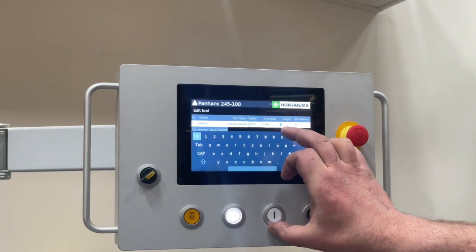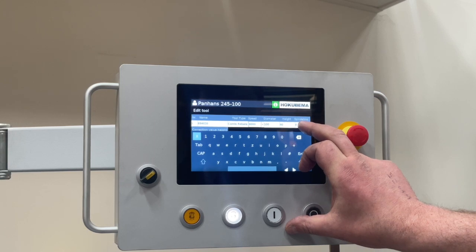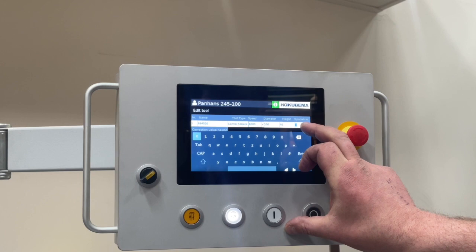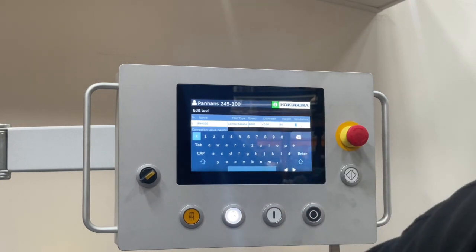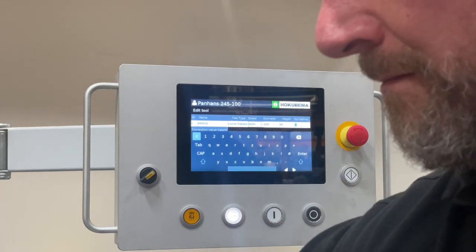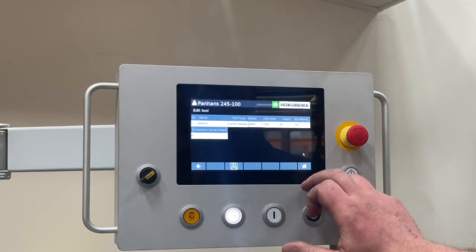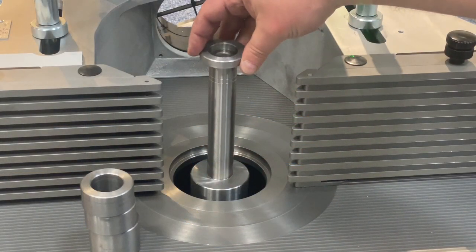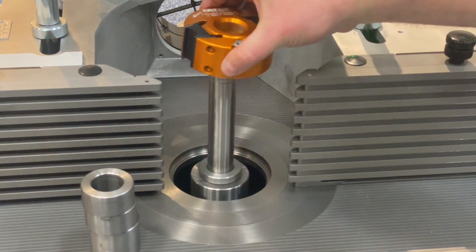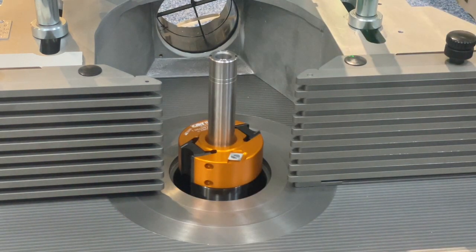Speed, diameter, height on this particular tool is 40. This point here explains the spacer that is underneath the tool on the shaft. So in this particular case, we're going to use a 10mm spacer. So we just enter 10 there. So there's the 10mm spacer, and the tool we put on. We take then spacers to take up the rest of the shaft.